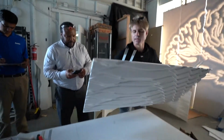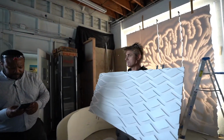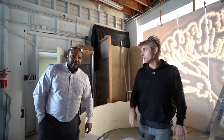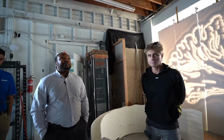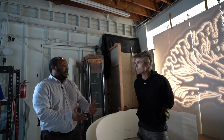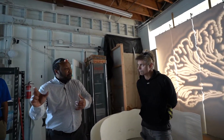Right? And this has only been, I would say, 5 minutes. Yeah, 5 minutes. And at which point is it okay to put it in the oven, would you say? Like how long should we let this bond before we start thermoforming it? So for the thermoform process, me personally, just to be on the safe side, I would wait 24 hours. Right. Because 24 hours, you have 90% of the strength of the tape. Okay. It's just 72 gives you that last 10%.